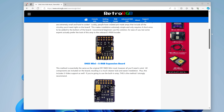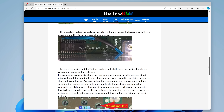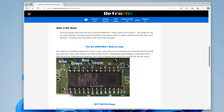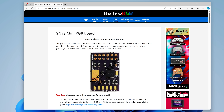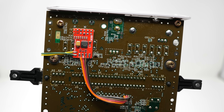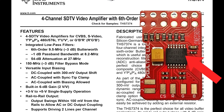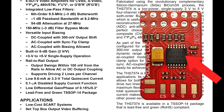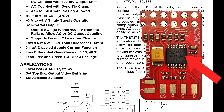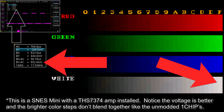There are a few ways to restore this capability to the SNES Mini. If you're on a budget, you could just handwire some components and use the chip that's already on the board — that'll work totally fine and you'll have a great looking RGB and S-Video output. You could even purchase an expansion board that makes this a bit easier. But if you're going to spend some time refurbishing and upgrading your Mini, you might want to consider getting a bypass amp. It works the same way as the onboard amp, however you're using more modern components with lower tolerances, which results in a tiny bit better RGB output. The RGB output will be the same on all One Chips, both the Minis and the larger ones.